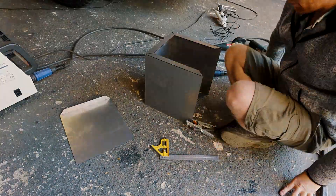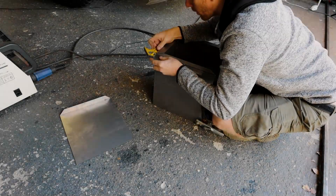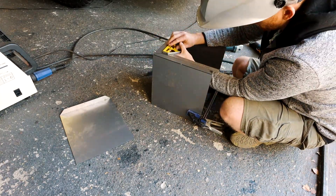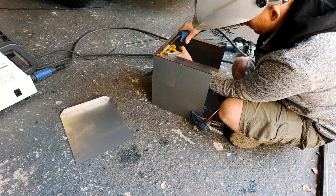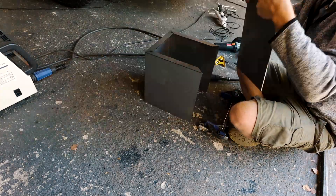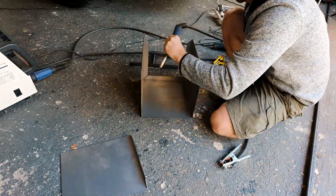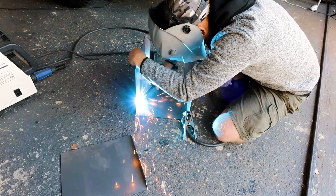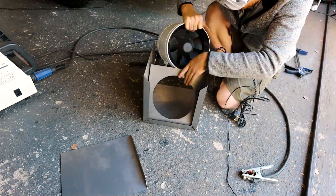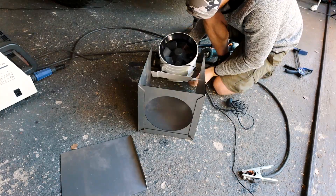Here are some specs on the fan that I chose. I got the EC250 model — it's not the cheapest but I think it will work great. I know that while towing a trailer or camper the inside becomes a low pressure zone, that's why dust not only finds its way inside, it actually gets forced inside due to the pressure difference. At full tilt the power draw is a mere 150 watts and it will never see max power. Moving 30 cubic meters of air per minute is a lot. The main reason for choosing this fan is that it can build a little pressure — most fans do not build pressure at all as air cavitates around the blade edges. This specific fan can build 510 Pascals of pressure, and it's got an infinite range of variable speed — you can spin this fan at exactly the RPM you want.